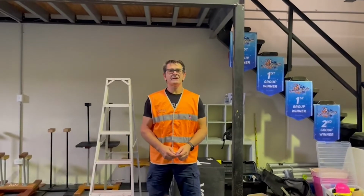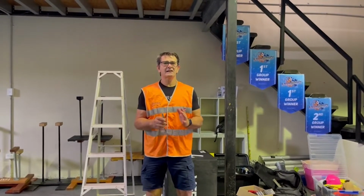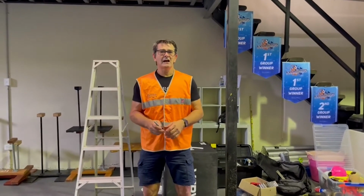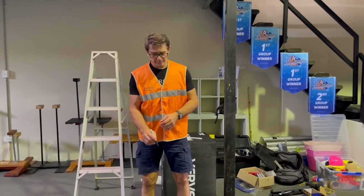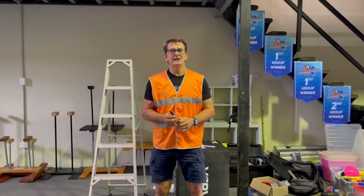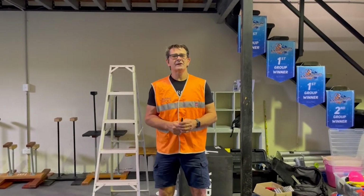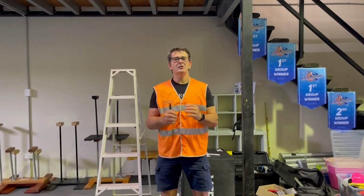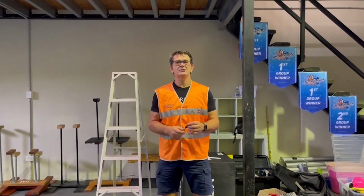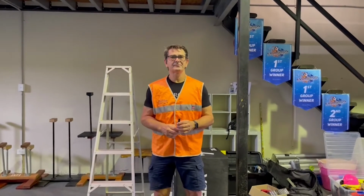Before we go up onto the beam to do the actual installation, we need to start by preparing our space with markings so that we can put it in exactly the right place we want it to be. On top of which, we need to mark our beam clamp itself to make sure it's sitting completely central to the beam. It might seem unnecessary, but once you're up there, it's much harder to start fiddling to get the beam clamp completely square, and it's much better to do it in advance so that it's all set like a little template for the beam clamp.